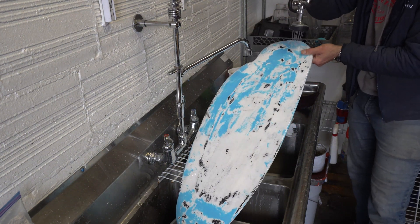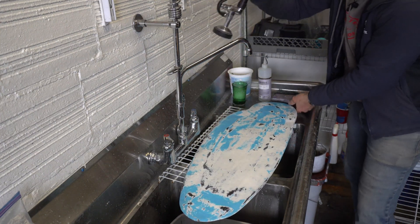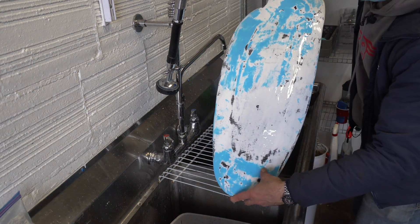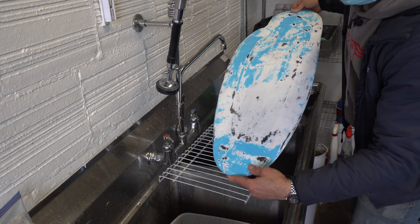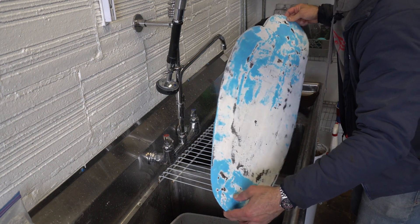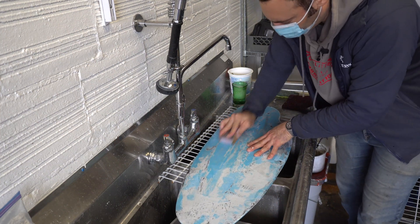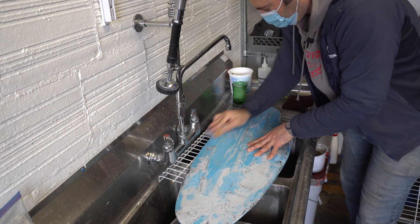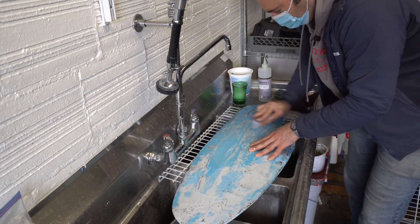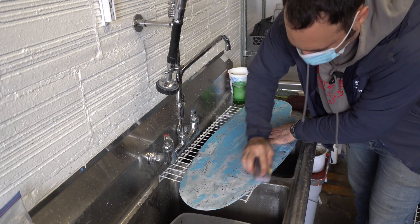It's very satisfying and I think this is how it gets to be smooth when it slices through the water. Now I'm exposing more and more areas of black carbon, meaning it's starting to eat into that perfect outer layer, so I am going to stop. All of this is used sandpaper. Which begs the question: is this design wrong? Because the whole premise of using the tubes, the sleeving, was that I could make a lightweight blade.